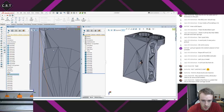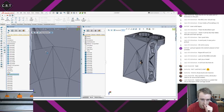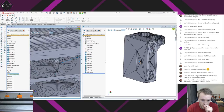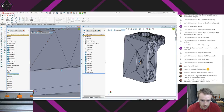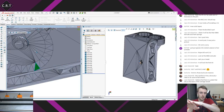So why is this? So on an STL, a vertex should always go to another vertex, but it looks like their geometry is so messed up that these vertices, they've got this weird plane in the middle of this part. Here, this side's fine. This side's all mating up. But over here, starting from there, by the looks of it. Yeah, here. It basically looks like they've got an infinitely thin plane between that curved part and the main face that's splitting the two.